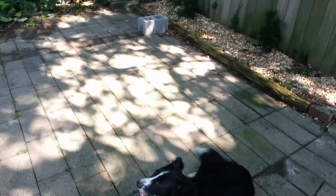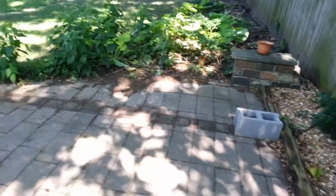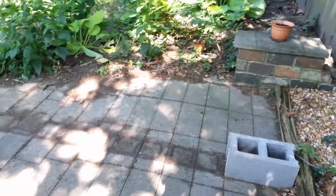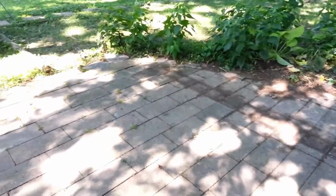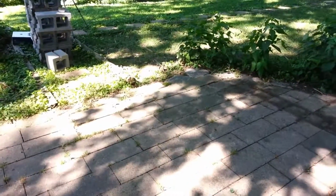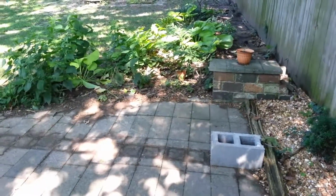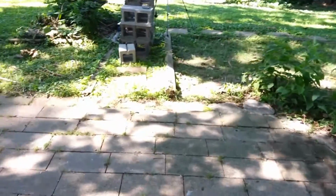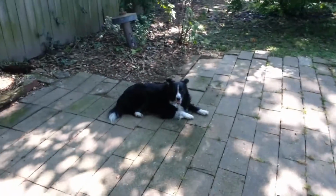After we get those cement posts cemented in on all the sides and the middles, I will go ahead and use mortar and put these cement blocks in all around. We're going to go about 3 to 4 cement blocks high in the whole square, leaving a gap for the front door that's going to be on here. And then above the cement blocks, we're going to have some screening put in, and then above that we will have the roof set up with 2x4s and plywood, and then we'll just do a roll of shingle across the whole top of it. So there you have it. That's our initial view, and this is how we got started.